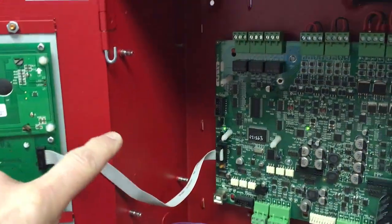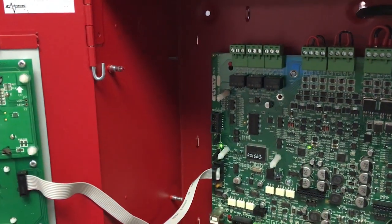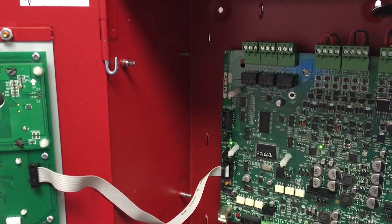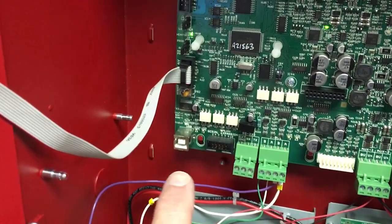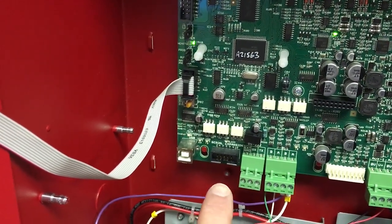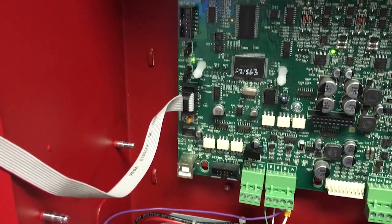We've opened up the fire panel. You can see inside — this is a CTL 2 V series panel, a larger panel. We're going to mount the digital communicator here on the sidewall, and down in the lower left corner we're going to install the SEB card. We'll also have to put the standoff in place to hold it down so that it doesn't fall out.